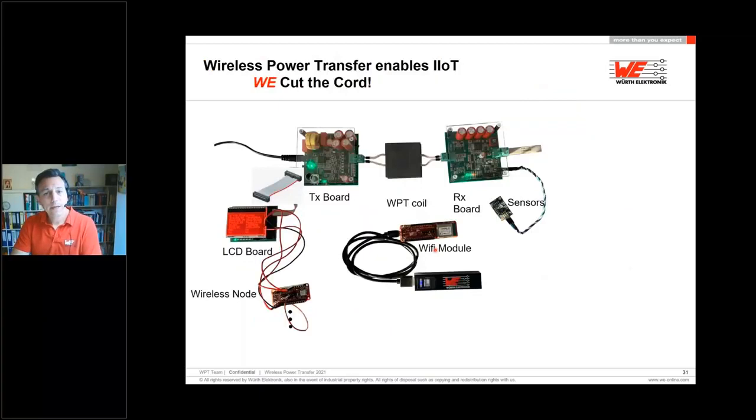If you would like to enable this system for IIoT, for Industrial Internet of Things, this is also possible with the system, as we realized a new board, an LCD board, and we updated the software. The software which is needed you can download on our website for free, and you need the DAVE software from Infineon to download and program it, and a debugger, which you can also buy at Digi-Key.